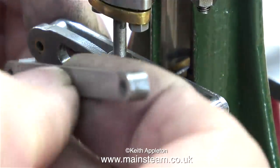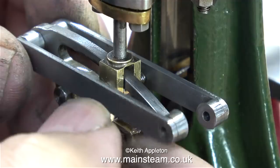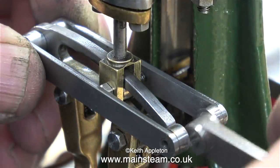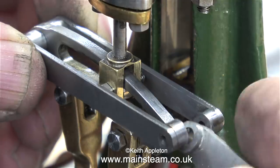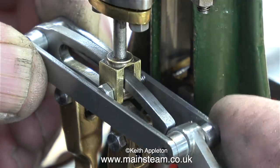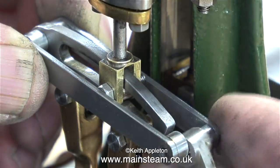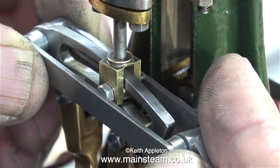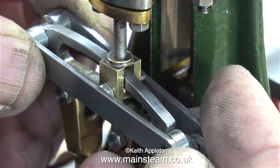This clip illustrates a problem in manufacture. The drawing probably assumes that you're going to use a casting, but a lot of builders would probably make these parts as I'm doing. I've reduced the width of the two barrels only at one end to allow the drop arm to fit in between, because the drop arm is wider than the expansion link.